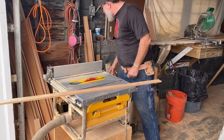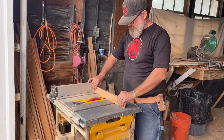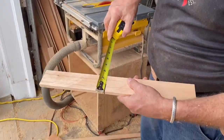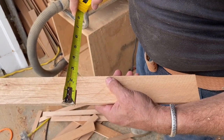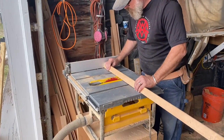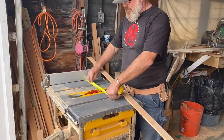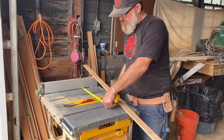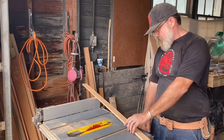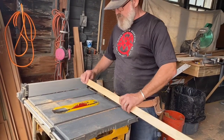I'm going to check it first. Does that look like an inch and a sixteenth deep? Oh yeah, it does. Nailed it first time. So that's my first mark. And then I'm going to do my outside mark — it's supposed to be eleven and five eighths to the outside. I got eleven and five eighths to the inside. So I'm going to make a first cut, and then I'm going to eyeball this one and eat out the rest of it.